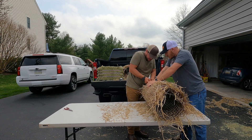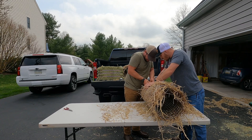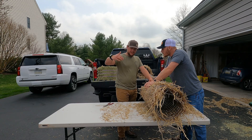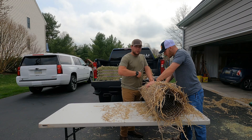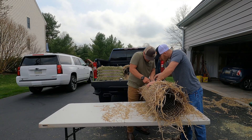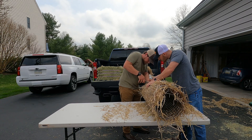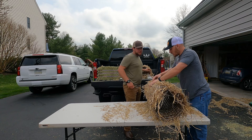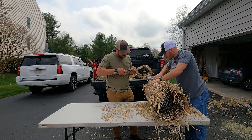This part's a little hard because it's filled with hay and it's going to be a little spread out. So if you have a friend to help, it's going to be a little bit easier. You can also get a pair of welding pliers — the big giant ones — and clamp it together so it holds itself. You can use channel locks, vice grips, to hold the fencing together so it's not trying to spring apart while you're clamping it. We're probably going to do five clamps on this one just because there's quite a bit of pressure from all the hay that wants to pop it up.